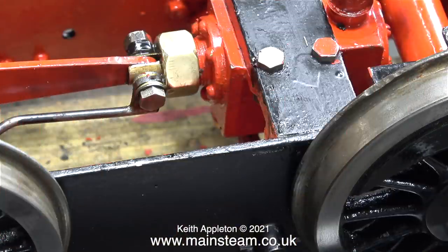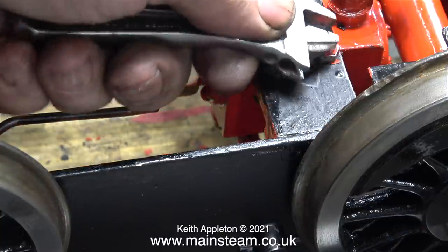I finally fitted the pin using a pair of lock nuts and some washers. I used a combination of steel and brass washers, which provided a very good bearing surface for the part that drives the oil pump.